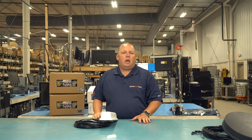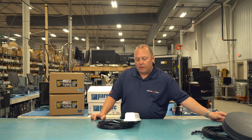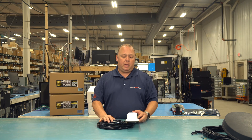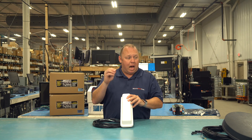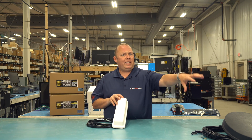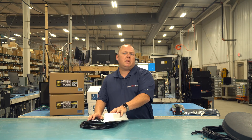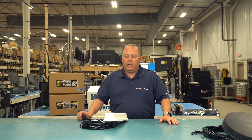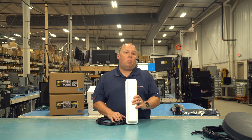The Belgian Shepherd is a true 6-to-6 antenna, meaning it covers 617 megahertz up to 6 gigahertz, giving support for 5G as well as lower frequencies like the 600 megahertz band popular with T-Mobile in rural areas. If you look at the specifications, some gain numbers are actually higher than on the Husky, while some radiated efficiency numbers on the Husky are a bit better. They're really neck and neck — it's hard to tell the difference, so we tell folks to focus on the form factor when deciding.